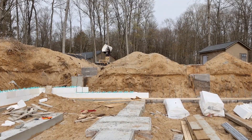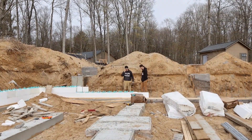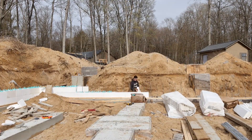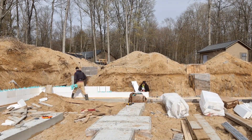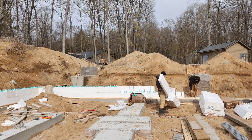Now it's time to stage some more materials down in the pit so we can get started on another section of the wall. We received our order of Quad Locks from the manufacturer in Georgia this past week. We're going to spot them around the foundation, and as each course goes up we'll put a horizontal piece of rebar in there to support it. Once the walls are stacked to the intended height, we'll cut the vertical rebar and slide them down into the channels.